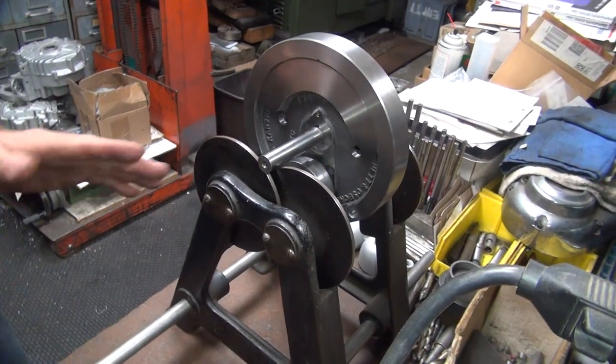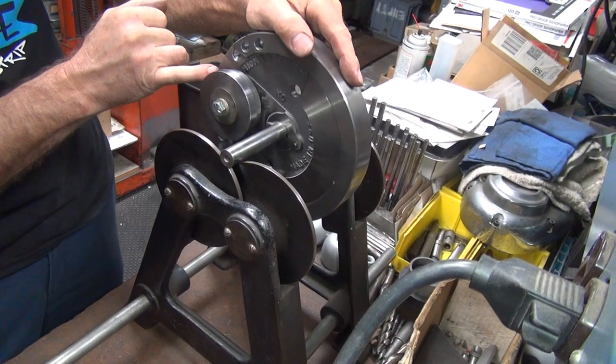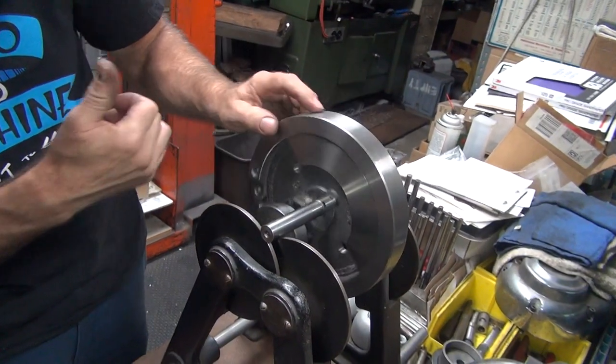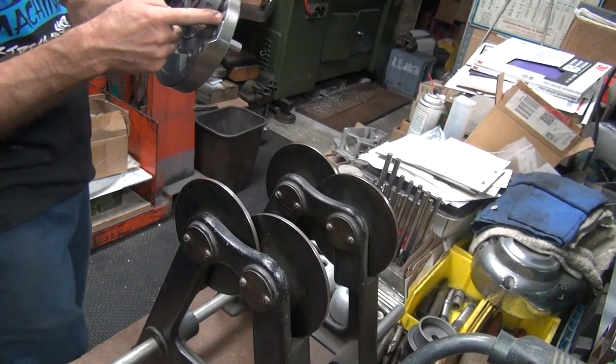We're not quite centered, but we're close. Now, as I cut more out of this hole right here, the one I just added, it's going to cock it centered, because right now it wants me to drill right here. So that's going to rotate it as I take weight out and balance it too at the same time. And we still need quite a bit of weight to see how heavy it is. So I'm going to drill out one hole.